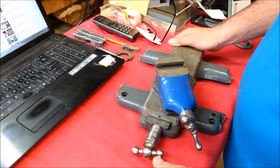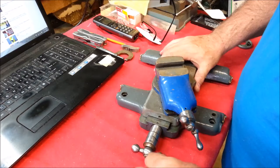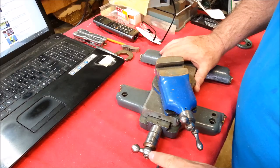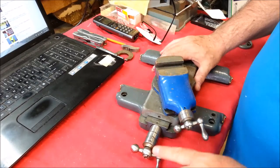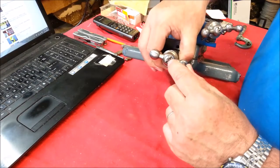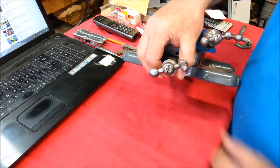Since I finished the pulley for the South Bend, now it's time to fix this carriage. Look at this bent cross slide. I hope I can straighten that without breaking it. This one's in good shape, but just the cross slide. So I've got to tear this down. This has got a spanner nut, and I need to make a special tool to get that off. That's the first thing I'm going to do — build that tool.